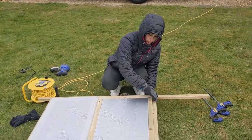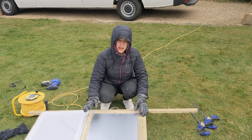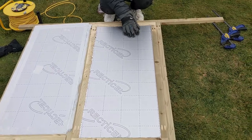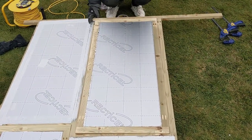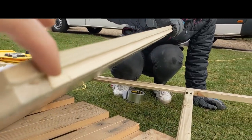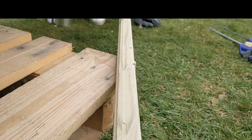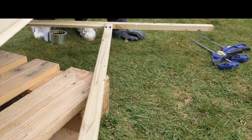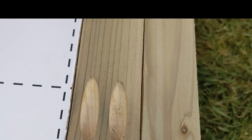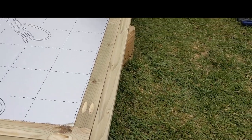This is our frame. We've now built the doors — not hinged yet. We've sanded everything down; there's still a mill gap here or there, but we're not too worried about that. We've got to put plywood on top and cut insulation. All we're going to do now is foil tape the insulation that doesn't have foil tape on it yet, and maybe go over some of the patches that we did before, which we've now sanded down and torn a little bit. The way we've built the doors — hopefully you can see — there's a channel on the back outside of the door frame, and the outer frame on the inside front has been cut out, so when they slot together when it's hinged, it will fit together much nicer. Even if there are some small gaps, you'll just be going through to that wooden lip, so any light won't leak through to the front of the van.